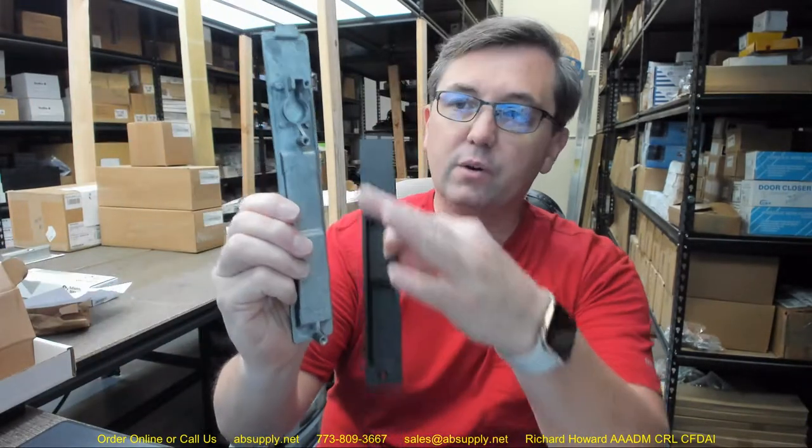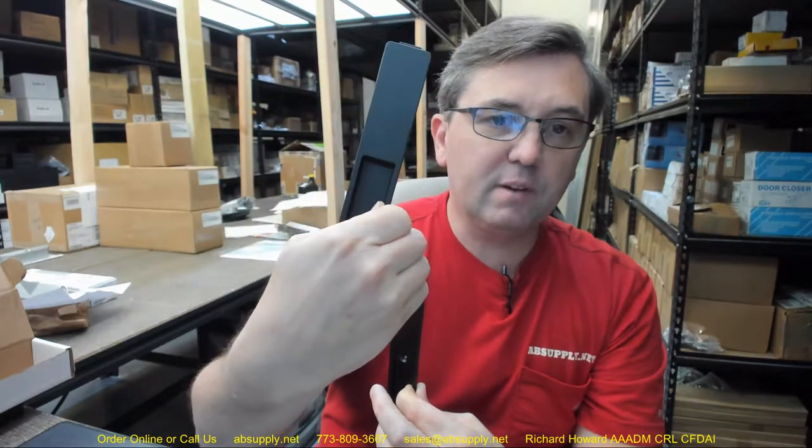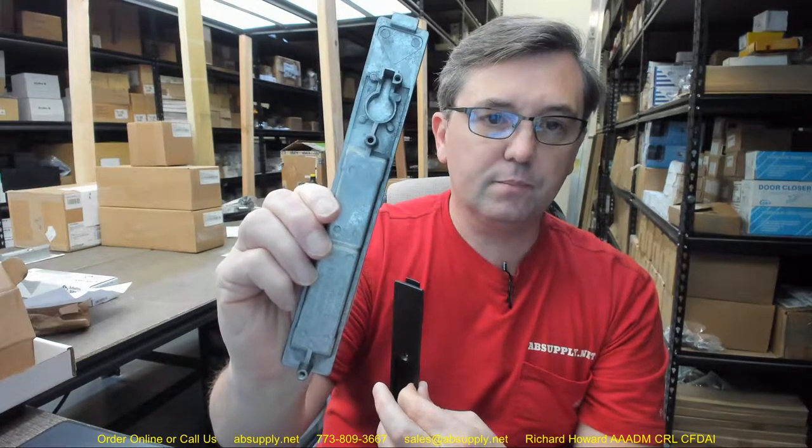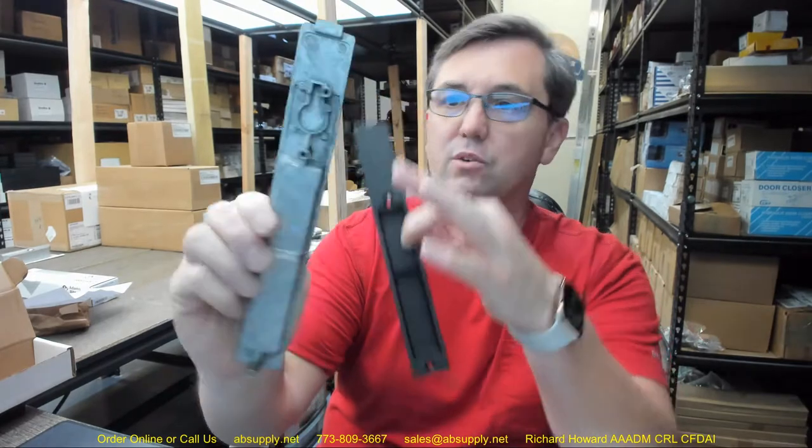It is sliding door hardware, exactly that. Outside trim, a lock body, inside trim, sometimes a strike plate, sometimes an interior pole that can be mounted on there as well. The interior pole will literally sit over these two screw holes, come off at about a 45 degree angle, and then screw through the trim into the tapped holes that are here and here. Okay, this casting would certainly permit a cylinder, but it's not been finished in the manufacturing process to accept a cylinder. You can see preparation for a cylinder there that's not been completed.